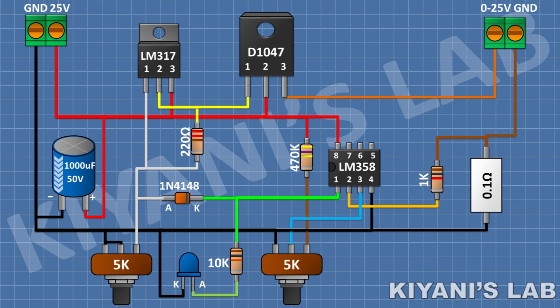After that, I'm gonna connect a 10K resistor and connect its 1 pin to pin number 1 of the IC. After that, I'm gonna connect an LED and connect its cathode to the remaining pin of the 10K resistor and connect its anode to positive supply. So, we have completed all the connections, now let's test the project.